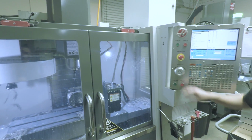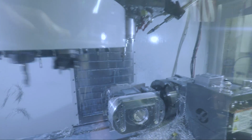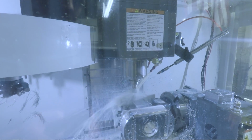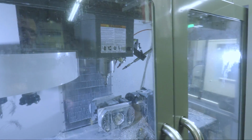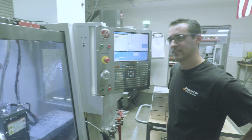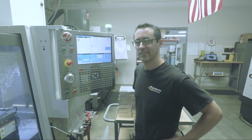I saw a good trick this morning at SH Machine, and they're running pretty crazy 5-axis type machines. They just have this dedicated tool. I mean, they have machines that have, you know, 240 holders, so they can afford the luxury. Sure. And they just put a copper tube in an ER collet with through spindle coolant, and they go into certain products and manifolds that they manufacture and flush chips out. Yeah, that's nice. I like that.